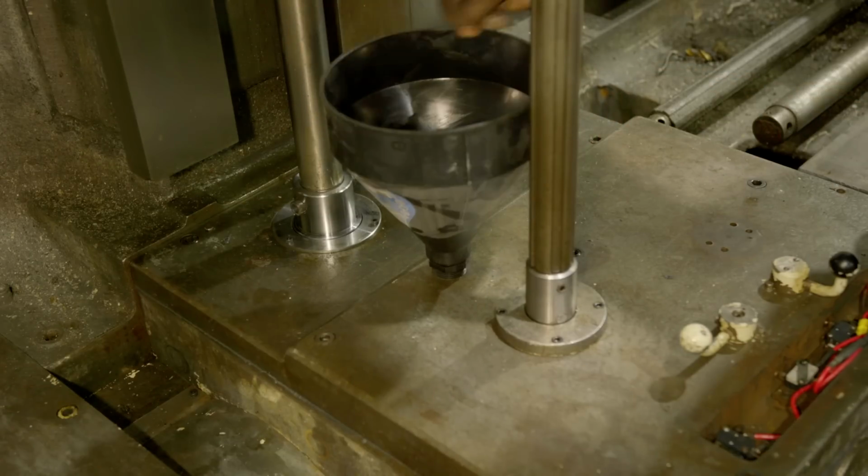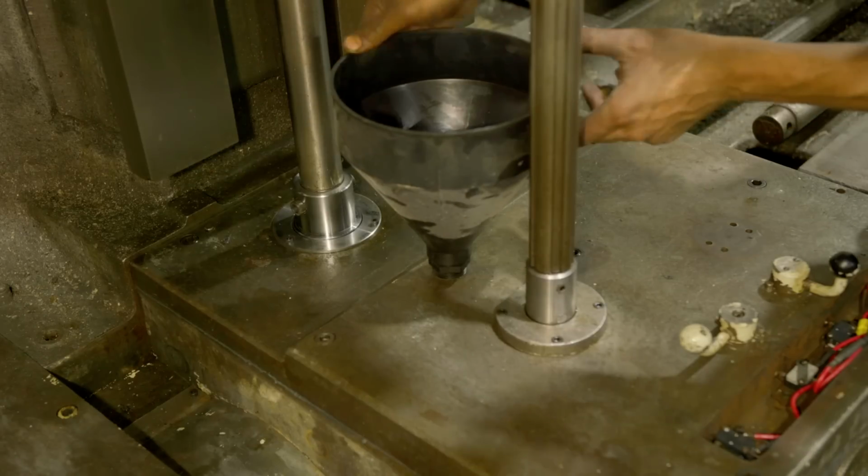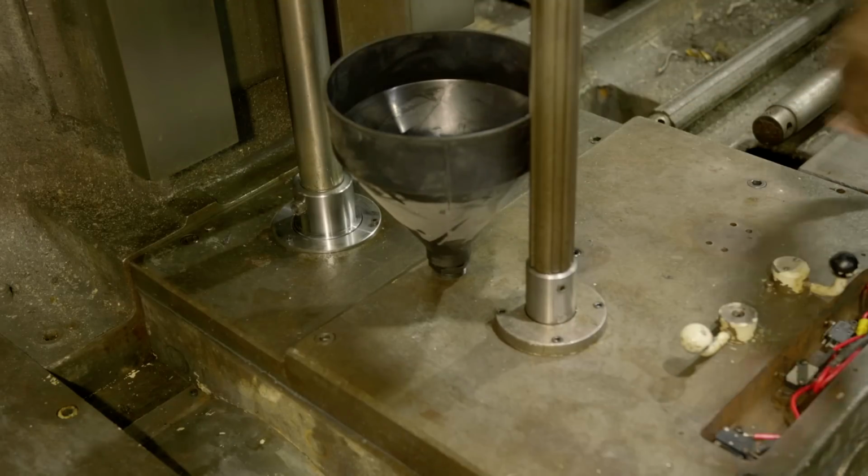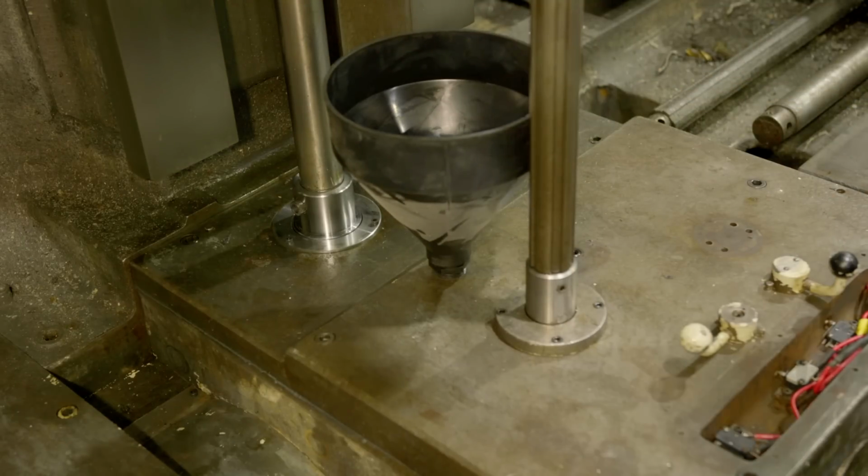As far as oil, there's going to be some oil Nazis out there. Using the right oil is important. I don't want to suggest that it's not, but this machine is 70 years old, and what was in there was mud. Most machine tools use a form of hydraulic oil. If it's your baby machine, get the right oil.